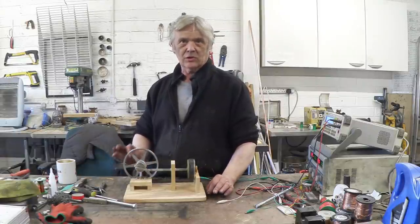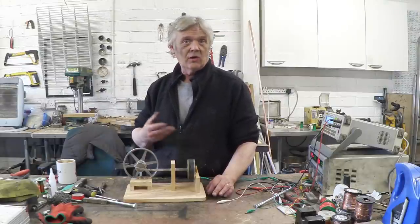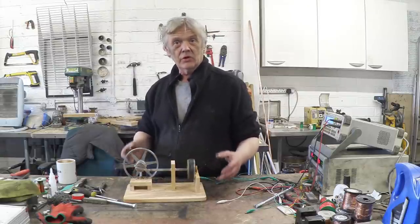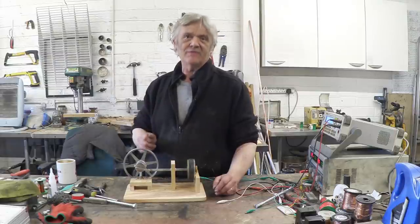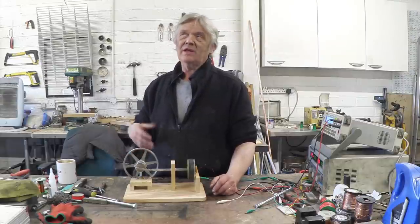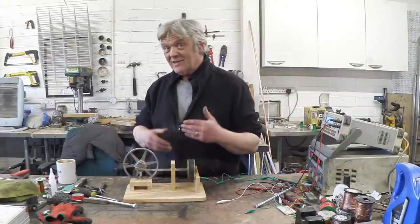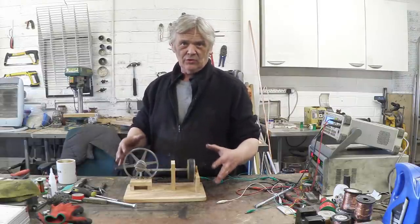We could do a rotary version of this, but I've done the linear version because there is nothing exceptional about the engineering. I used stock materials to ensure the right sizes: a 12mm pipe with a 1mm wall and a 10mm bolt — you'll find those absolutely everywhere. You'll find progressions of pipe sizes where one will slide inside another to quite large diameters. I'm using the intrinsic benefit of materials that have already been engineered. If you've got a 10mm bolt, it's for 10mm — so those scrap materials fit together and I didn't have to do any engineering myself.